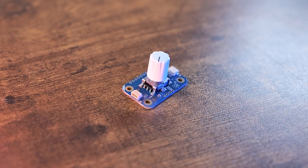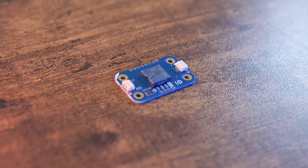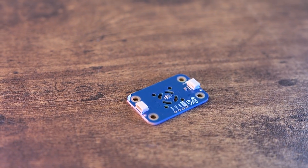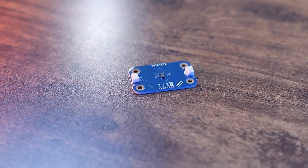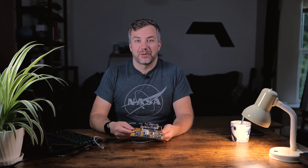So what are the Modulino boards included in the set? We have a Knob — a rotary encoder with a button. Modulino Buttons contains three typical push buttons, each with an associated LED you can also trigger. There's a Buzzer for making various sounds. Modulino Thermo has an embedded temperature and humidity sensor. Modulino Pixels gives you eight individually addressable RGB LEDs to visualize data and create animations. There's a Modulino Distance sensor that uses a time-of-flight light to measure the distance of an object in front of it. And finally, Modulino Movement contains a gyro IC that generates information about movement in three axes.